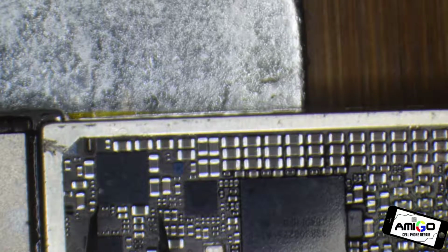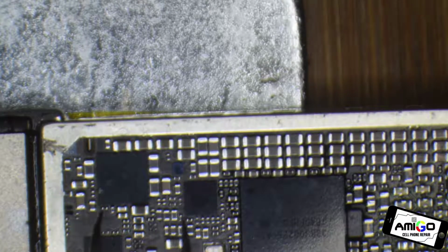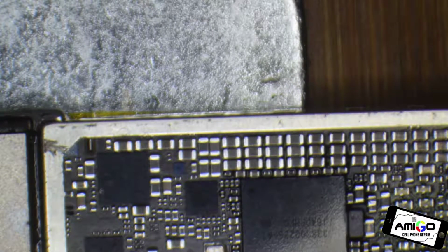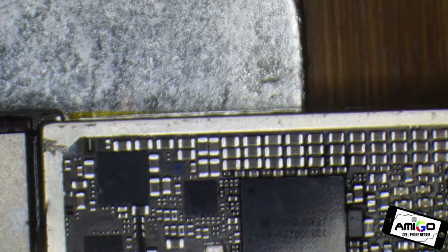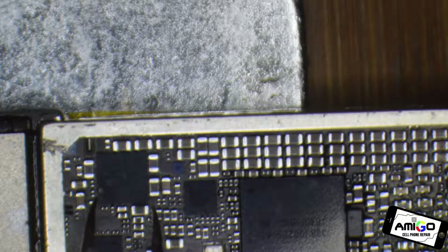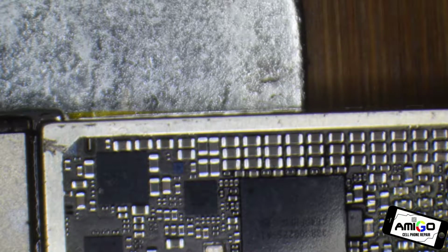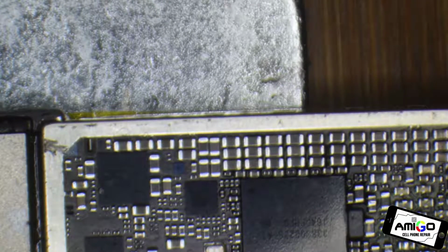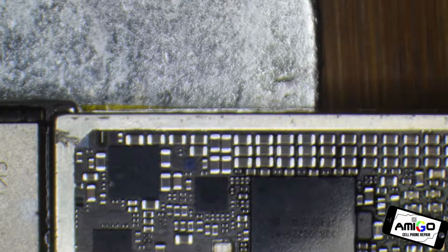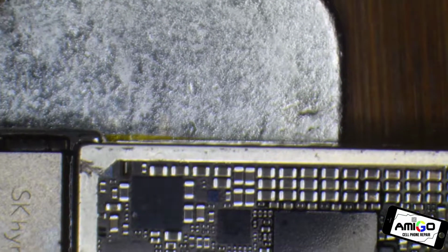This one is a microchip made by Qualcomm, but we also have another microchip for another model of phone that is made by Intel. So Qualcomm provides this chip, but maybe a pad is loose underneath that microchip. So we just replace that microchip and that will take care of error 4013. When you try to update through iTunes, you're not going to be able to do it because you have a problem with that microchip.